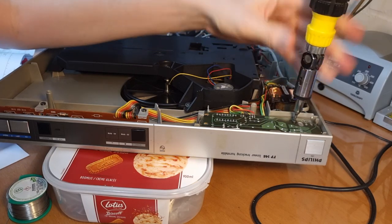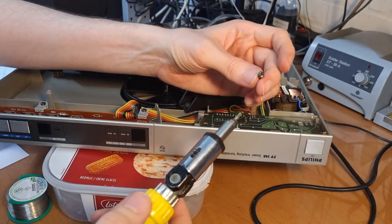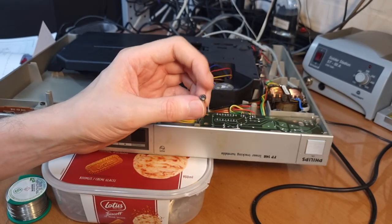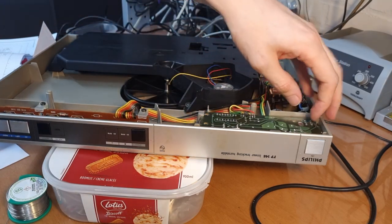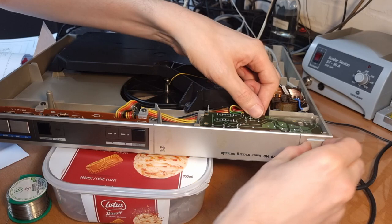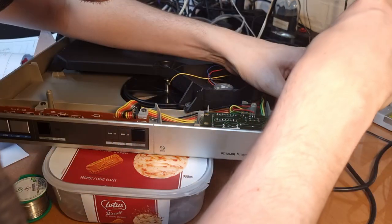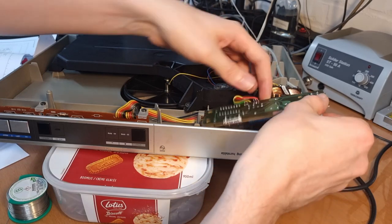Now, the cool thing is these screws here, they are not all the same, but they have the same head. They are a T10 safety bit, but you can also use a flat screwdriver to tighten or untighten them. So that's cool. And I think this PCB is only held in with this single screw. Yeah, and then obviously also the keycap, which maybe we should take out first. I don't know. Yeah, I think it needs to come out first. That's the keycap. All right.